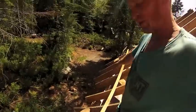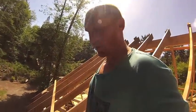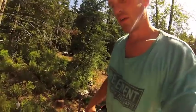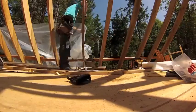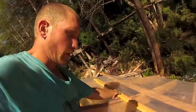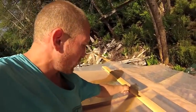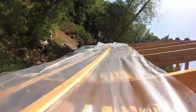The pieces are cut off, so I should bang these nails in. My next plan is to lay some poly down - it's a temporary solution before we get the metal roofing in. It's going to keep all the wood below nice and dry, and then I can just put the metal roofing right over top. It's not ideal really, but we'll see how that goes. Now I'm putting my strips down on top of the poly just to hold it down in the weather. I've got a little mark here I'm positioning on, and since my piece is nice and warped I'm going to be bending it back right into place.